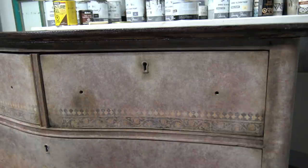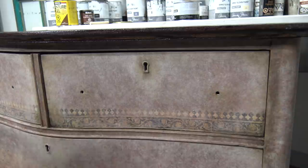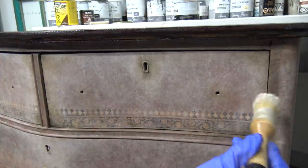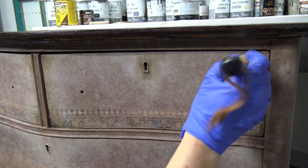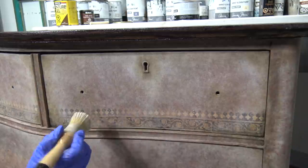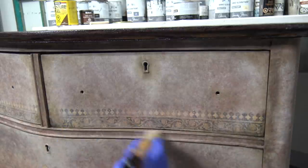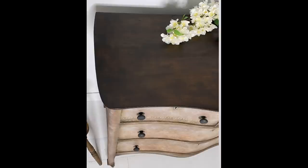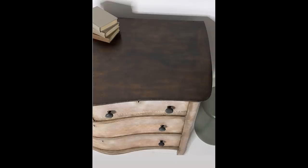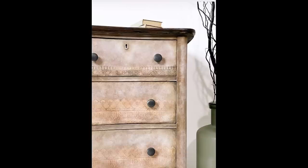Grab a little bit of that clear wax and you can wipe back any of the dark wax or mellow it out. I also wanted to add a few highlights all around the piece with some white wax — just add that highlight right next to the low lights. The clear wax is needed to seal your chalk paint projects, but the decorative light and dark waxes are options if you choose — they're very impactful and fun to use. Thank you so much for watching and I hope I've sent some inspiration your way. Leave a comment below, subscribe and share, and I look forward to seeing you next Saturday for another chalk paint decorative tutorial.